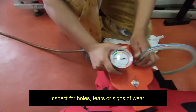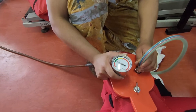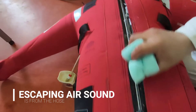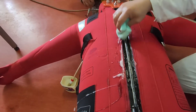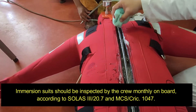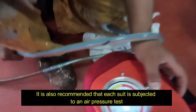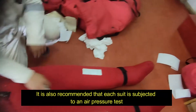We have to keep the pressure on the green. We set it to one bar. We also put water so we can detect any leaks. We wait two to three minutes.